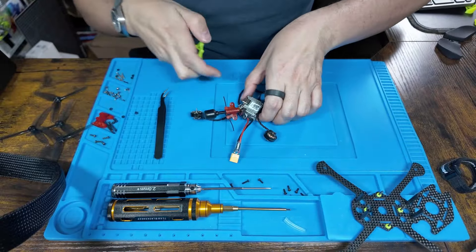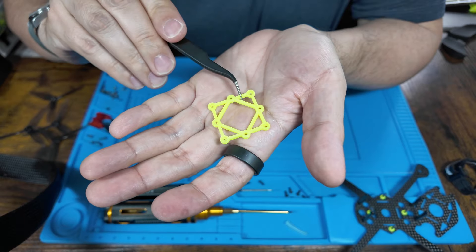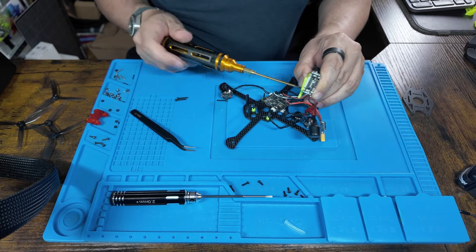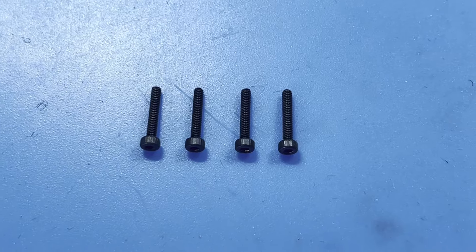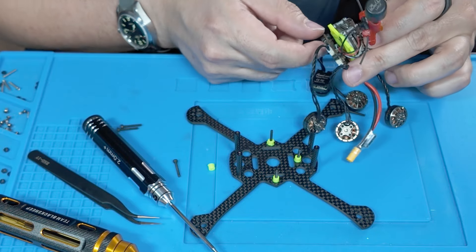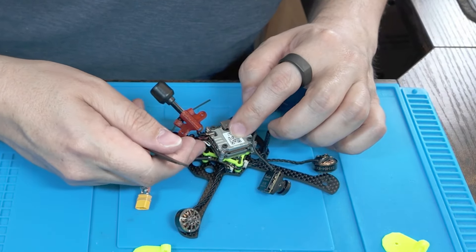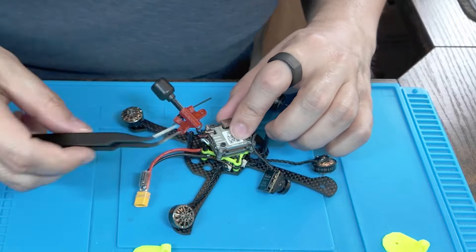What we're going to do next is bolt the 3D printed adapter to the DJI Vista. It's important that you do this this way around because it's a bit more difficult to screw the adapter plate on once it's attached to the AIO. In order to attach this you are going to use the M2 14 millimeter bolts as these fit almost perfectly. Then take the AIO, sandwich it on the other side of the adapter, add this to the frame — it will just slide straight on — and then bolt those down with a set of M2 nuts or the original nuts that came with the Crux 35.